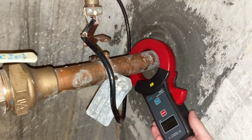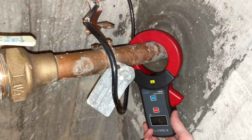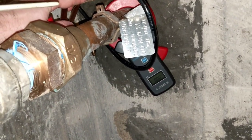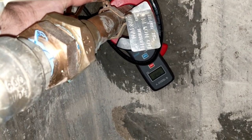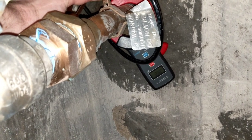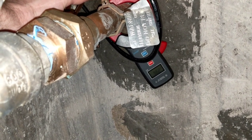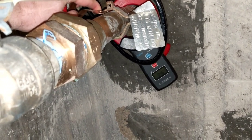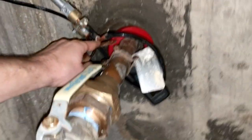You can see now as we clamp around that, we have a zero. Now you can read the meter and see what happens when I touch this — current flows. No current. There's the current again. We have to make sure that this grounding strap does not touch the pipe nor the fitting. That's an easy fix.